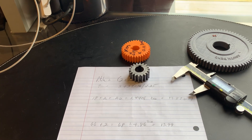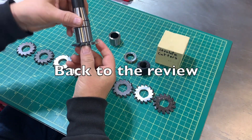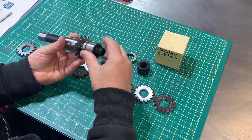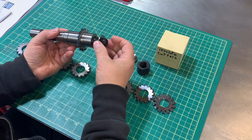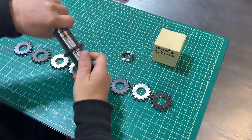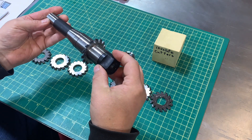I'm going to see if we can do this with these 16 diametral pitch involute cutters. Let me put the gear cutting mechanism on the correct spot, line up the keys — there we go. We need one more washer in here, then put the nut on and tighten it up later. As it turns, it's going to cut the gear.